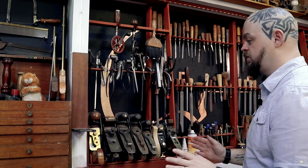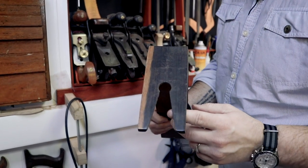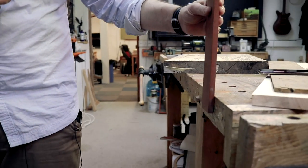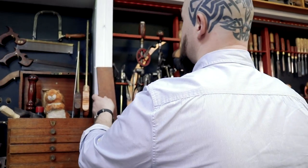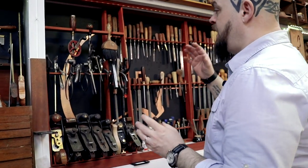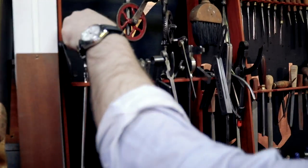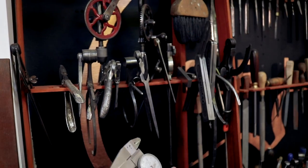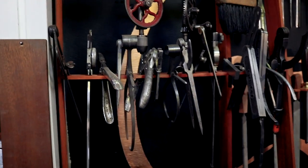And I then go to, for example, this crimson inlay jig. It's a special edition we did with ebony. I use this for cutting out inlays and doing fine work, raised up on the bench quite high like so. Well, I put it in a vise, of course. That is used and is very useful. You can never have enough marking tools. You need vernier or dial calipers. I've got several. Especially with guitar building, there is a lot of precision involved.